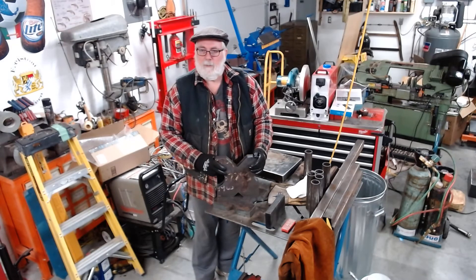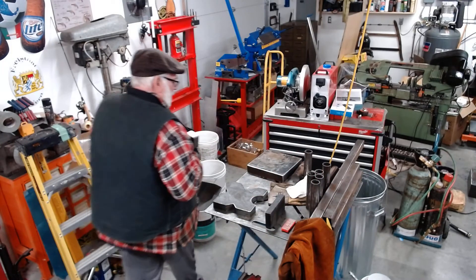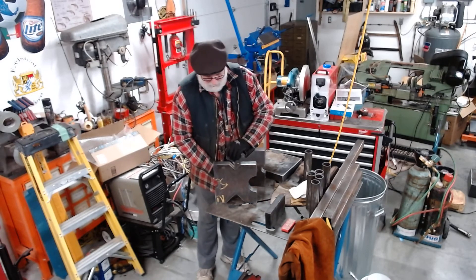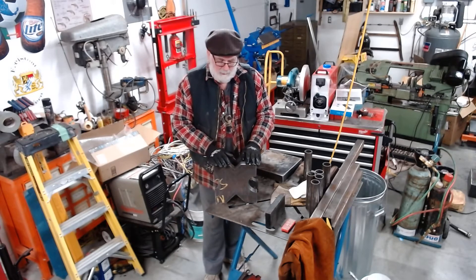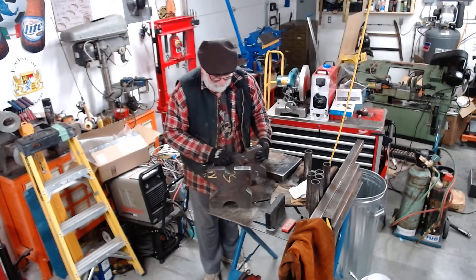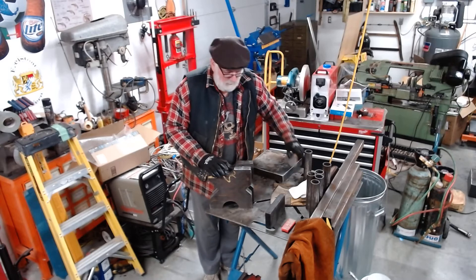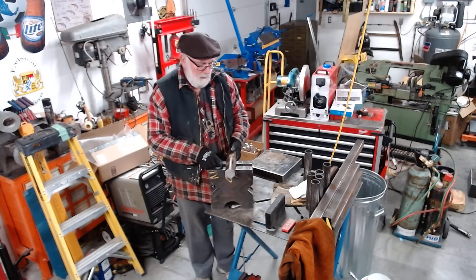I had him cut out these plates and they're heavy, but it does a really smooth cut — actually an amazing cut for that thickness of metal. They've got a shape on each side, and each plate is a mirror of the other one so the shapes match up. Probably the handiest feature is this hole — I thought it was a two-inch diameter hole, and sure enough it's two and three-sixteenths, so basically a two-inch diameter hole.